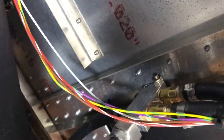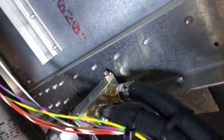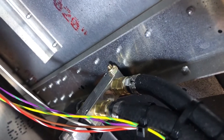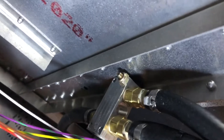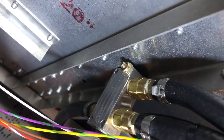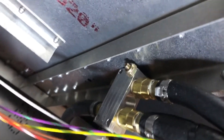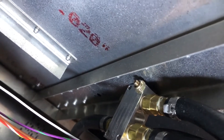That splitter is explained in the fuel system as a check valve assembly. Basically, each hose from each pump goes into this aluminum block — all passages in the block are connected, so it doesn't matter which ones you use. There are two check valves right here, one for the left and one for the right, so that fuel cannot flow back through the other pump.